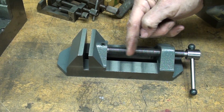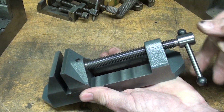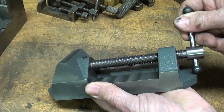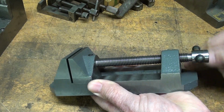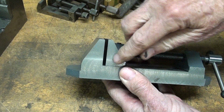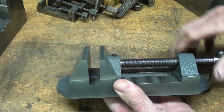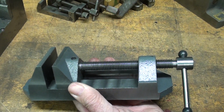You will recall when I made the screw, it was extra long, and I said this is way too long, and I shortened it up. Well, in the process of shortening it, which was a foolish move, now I have interference right here with the handle and the lug of the vise. Well, we're always holding something in there. We're not holding a sheet of paper, so it will always be out this far, but I did get some criticism on that. And also, if I had put steel jaws in here along with some V-grooves, that would space it out so it would be more like that in the closed position if there were 2¼ inch plates in there, or 3/16. So that's just another observation.